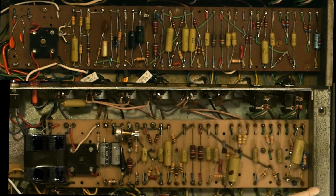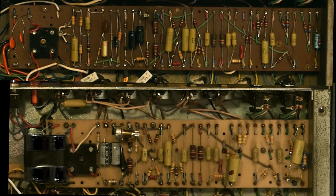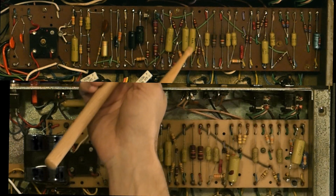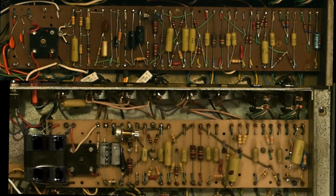What this does is add some extra mid-range and high frequencies as well as gain to the bright channel of the amplifier. Once again we see an additional 0.68 added to ground in V2, which also adds additional mid-range bright frequencies and gain for the normal and bright channel of the lead amplifier. In V3, which is the phase inverter of the bass circuit, we see the 0.1 capacitors, which is a larger value capacitor than the lead circuit. The 0.1 capacitors allow for a little more gain and bass in the output coupling stage of the bass circuit.